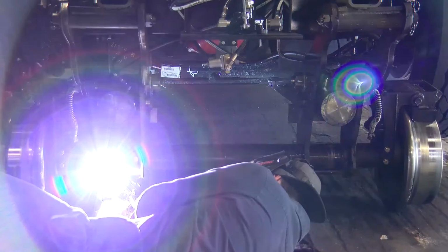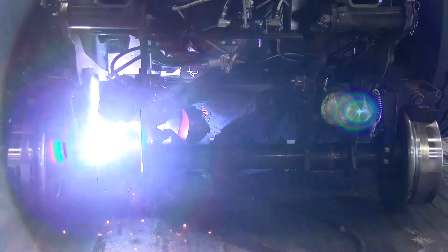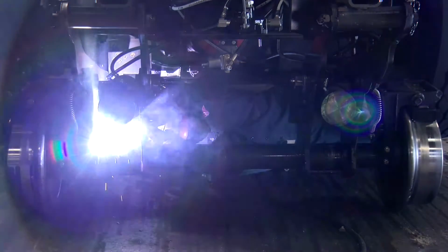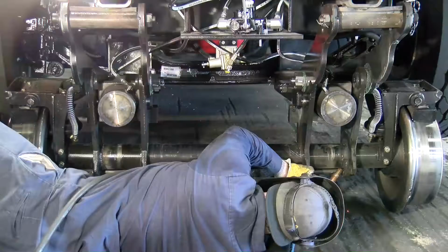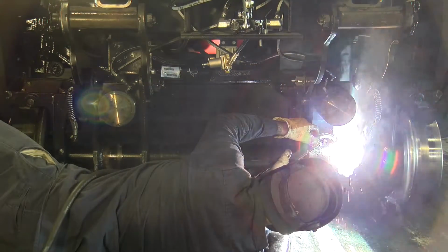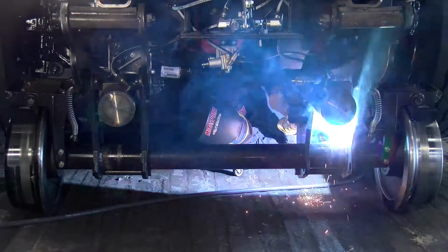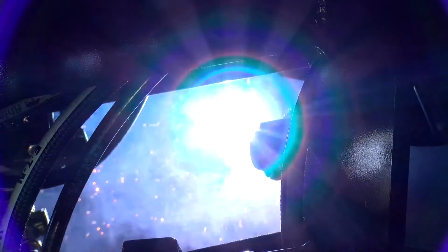Once all adjustments and testing have been completed, the front axle tubes can be structurally welded to the outer pivot arms. This needs to be performed with the rail gear deployed. Run a weld bead all the way around the inboard face of each outboard pivot arm. Do not weld the inboard pivot arms to the axle tube. This would prevent servicing the hydraulic cylinders in the future if needed. Fully weld any front pivot arm shims in place. If the front cross tubes were moved during the alignment, fully weld them to the truck frame.